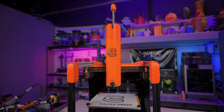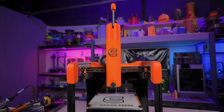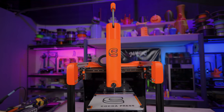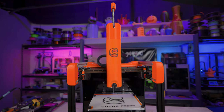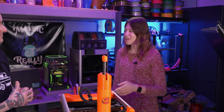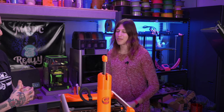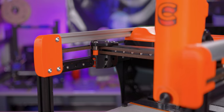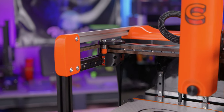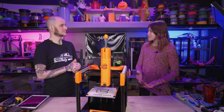This is a clearly unique 3D printer — it's not your standard. It almost looks more like a pellet extruder or something like that. Core XY kinematics, with this big extruder housing in the middle. This printer is based on the Voron V0.1, and we worked with Max — who's RCF, the founder of the Voron project — on this new design. Standard Core XY printer. Once you're printing in chocolate, there are things that are much harder about building a printer, but also things that are easier.